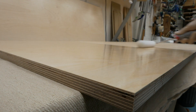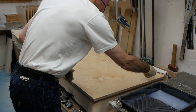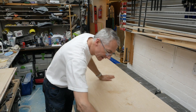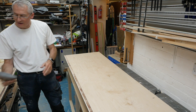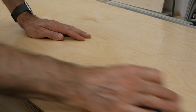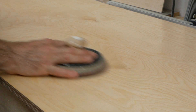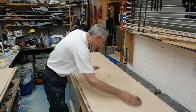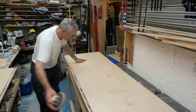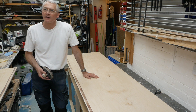I'm not going to subject you to the full process again, but you can see how nicely this third coat of lacquer is going on, bringing up the grain of the birch ply really well. This is all dry now and it really is a lovely finish - nice and smooth. We're going to go over this with some P2000 Abrilon on a hand backing pad, just to de-nib it and give it that really super silky smooth finish - the kind of thing where you can't quite stop touching it. So that's basically it for the finishing. We can start getting the domino connectors in and start thinking about getting this together as a dry fit.